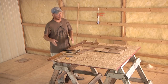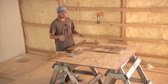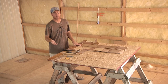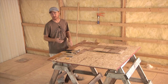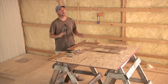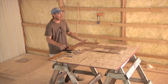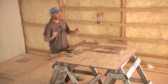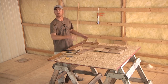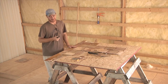I've gotten the top area cleaned off — I just hate working in clutter, and it's not safe. Now I'm going to see if I can salvage this top piece. If I'm able to do it, it'll save a fair amount of work and material costs. A lot of these repairs were unanticipated costs for the owners, so anywhere I can save money without compromising quality I'm going to try to do so. Once I get the old plywood layers off, it looks like I'll have a fiberglass skin of about an eighth of an inch, which I can use as a template for cutting the new coring material.